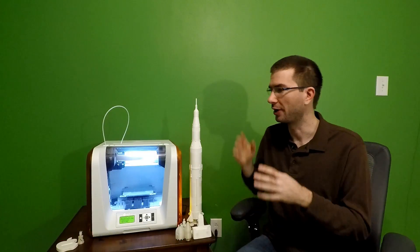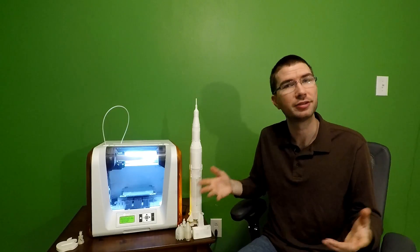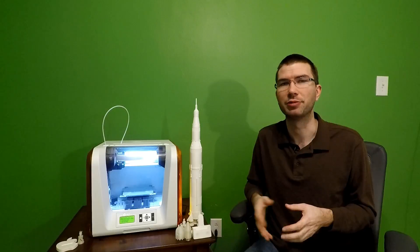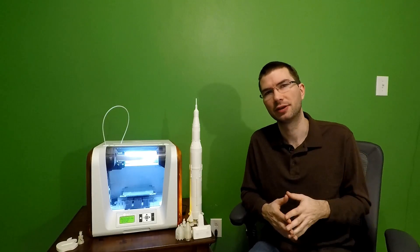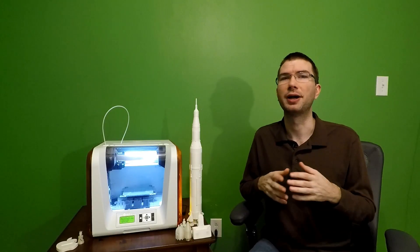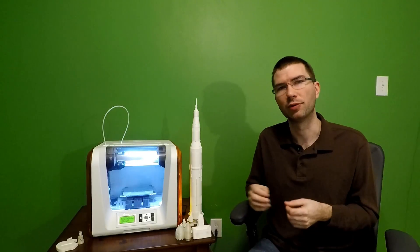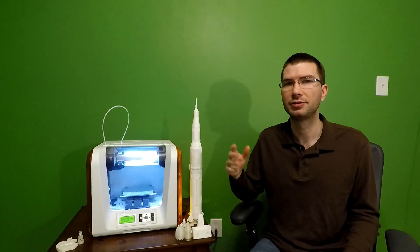What we've got is a pretty standard machine: a 0.4mm nozzle, no heated bed, so it's PLA only. It's got a pretty decent build volume at 5.9 x 5.9 x 5.9 inches. It also has a maximum print speed of 100mm per second according to XYZ's site, and this will fluctuate depending upon what is being printed and how it's being printed. The layer resolution on this printer is anywhere from 0.1mm to 0.4mm, so it can go from very fine to very coarse.